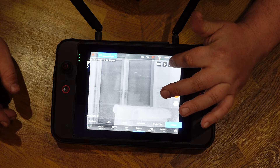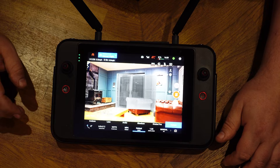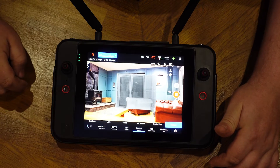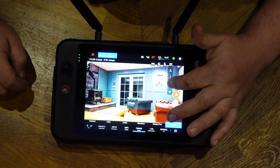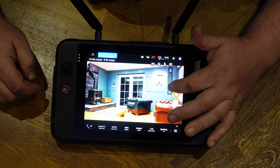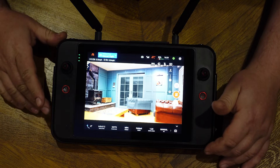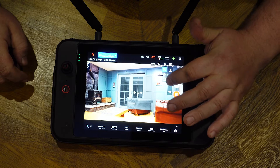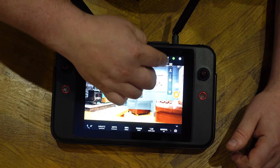There are loads of other settings as well. You can mix and match — you can see the outline in optical color and the thermal in the center. You can adjust it to tone down the thermal to almost have it integrated so it's barely noticeable, or turn it up so you're not losing the overall sight picture. There's also temperature measurement which gives you spot temperatures, useful if you're doing a survey on a building and need to know exact temperatures.